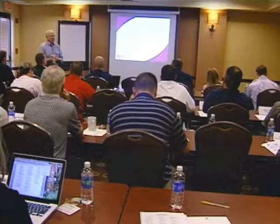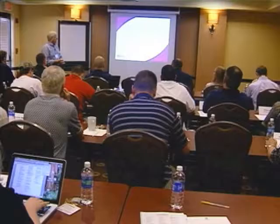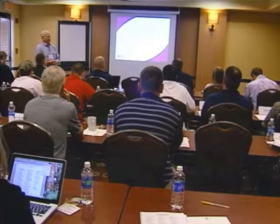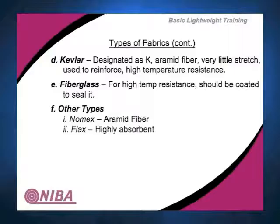Kevlar does have pretty good temperature resistance — not as high as fiberglass, but it does work on certain temperature applications. Fiberglass as a fiber is spun and is fairly brittle, and it's usually impregnated and coated to seal that. Nomex is another aramid fiber — it's reminiscent of the nylon family and has very good temperature characteristics.